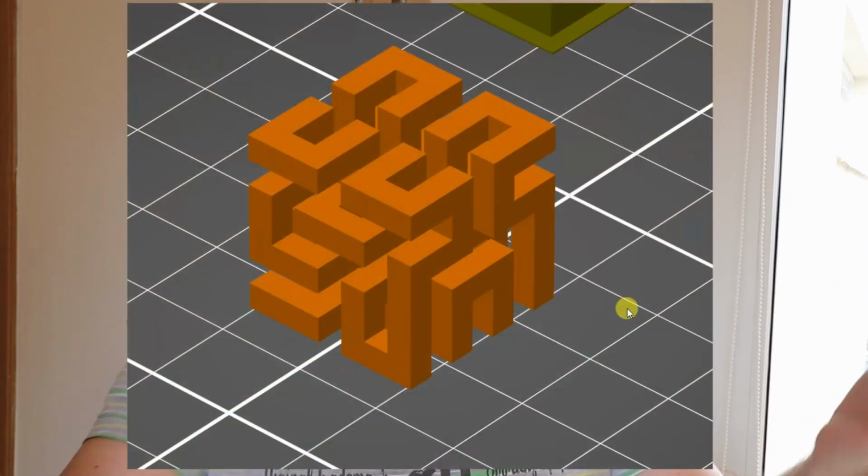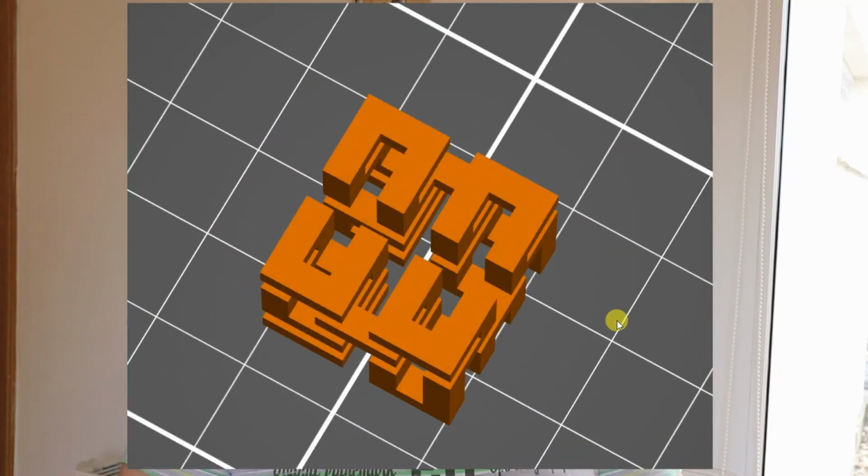Compared to the conventional method where the supports are printed with the same material as the object, the surface is not much better with the soluble filaments. It may be practical if the contact part of the object is too thin and there is a danger that you will break it trying to remove the supports. Or maybe it is very closed, you cannot reach the contact surface with pliers, like the Hilbert cube, which is a typical ultimate test for soluble filaments. Then again, using soluble filaments is maybe practical there.